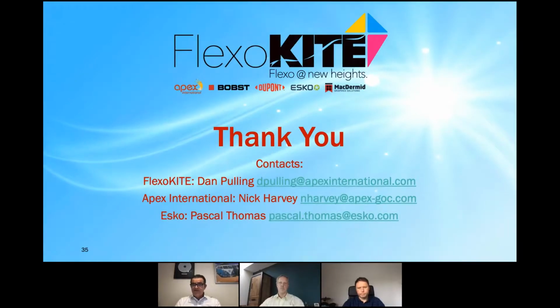Yeah, sure. Again, it's a true partnership to get to the right results. It's understanding where the difference is between a 200 lines per inch and a 240 lines per inch, both with an 8 volume, and the same with the difference between an 8 volume and a 6 volume. There is a different screen pattern for the plates, as Rob explained, that will better suit and be more effective in relation to one of those engravings or others. The complexity comes, as I said in the presentation, from there being so many different specs to choose from that it's almost a moving target for this plate screening to be effective.